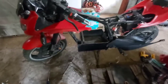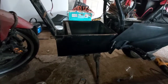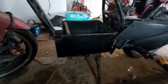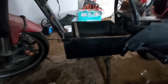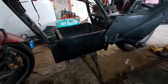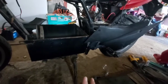It looks like this battery box here is welded all around — this bottom one. The top one isn't, but the bottom one is. It's probably going to be difficult to get out of there, so I'm going to have to make my own battery box. I definitely won't be keeping that size of battery — if I use these A123 packs I'll have to make something this long, and I'm not going to cut them.